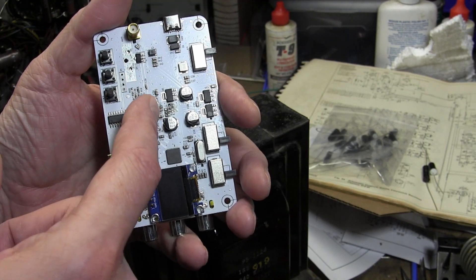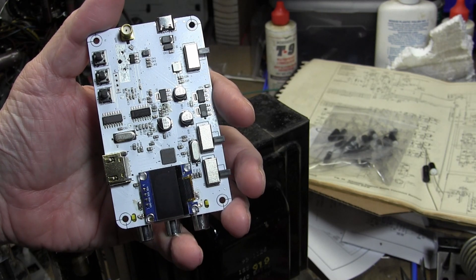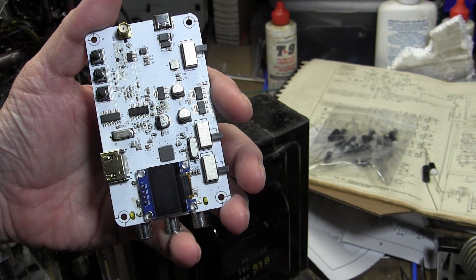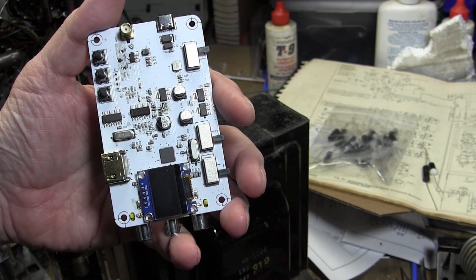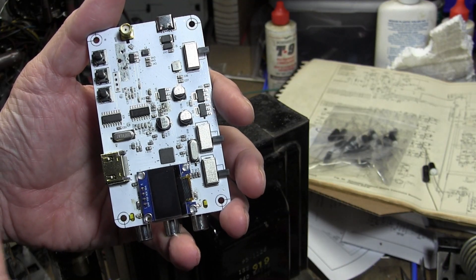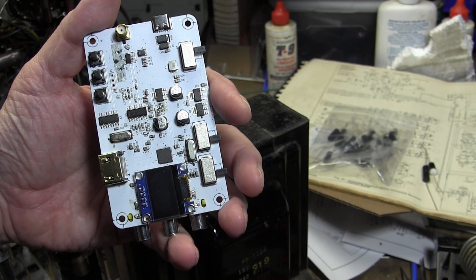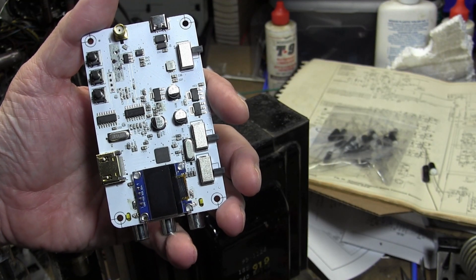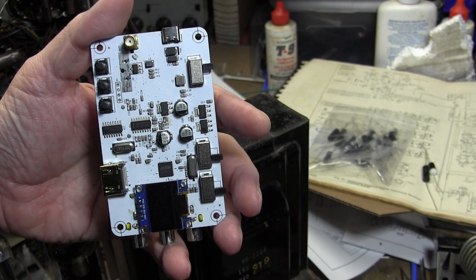If you read the code out and do a little research on how that chip works, you could search for the hexadecimal values of certain registers, or knowing what frequencies it supports, maybe look for those values in a table. I would imagine it wouldn't be too hard once you locate that table of available frequencies to modify it for domestic U.S. use, if you really want to go that far.